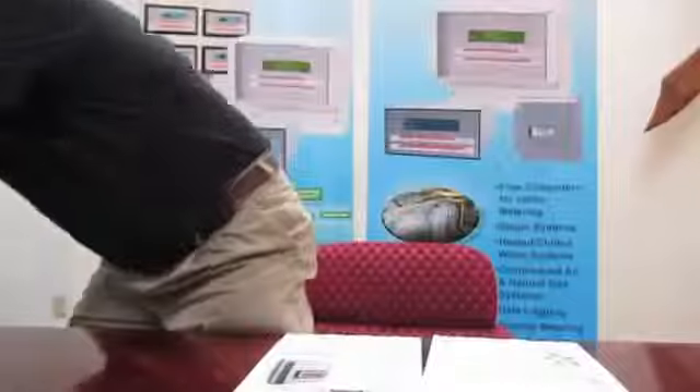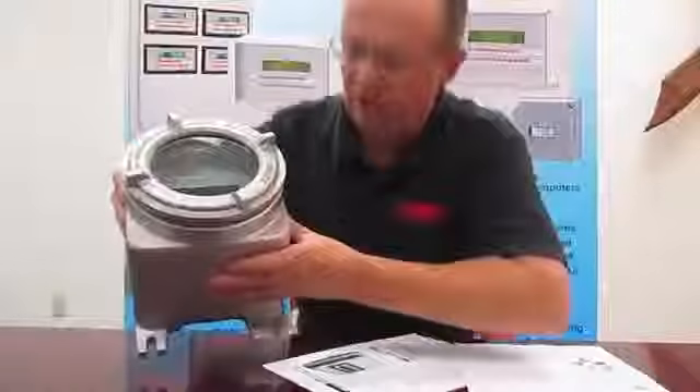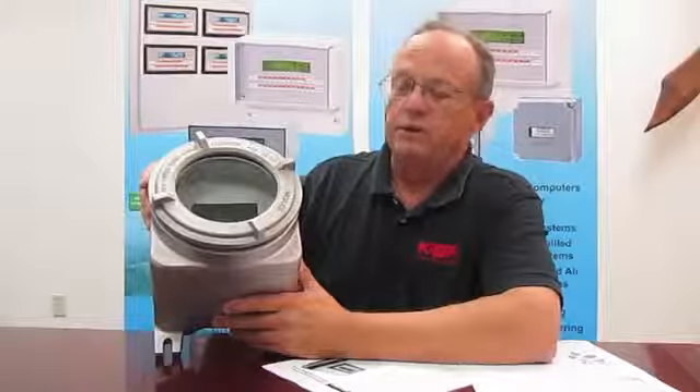The final classifications we're going to be discussing today are ones going into explosion-proof areas. These are the hazardous areas where the goal is to prevent accidental ignition of flammable mixtures of either liquids or gases. These enclosures are suitable for indoor or outdoor use and are basically large castings of aluminum.